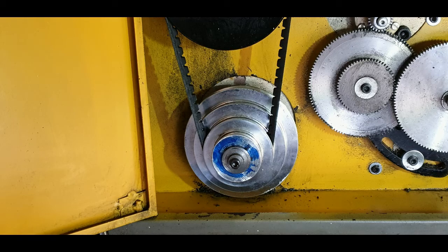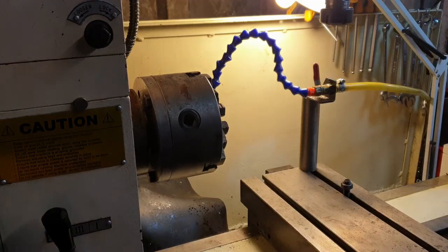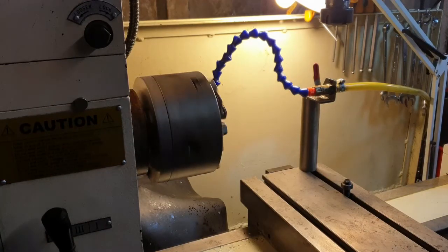When searching for a 19 millimetre stepped pulley, the only one I could find was a five-step. However, as you can see in this photograph, there are only four grooves — I had to machine the fifth step off the pulley. With everything fully installed, I also treated myself to a new set of V-drive belts. I went to the local garage, took the existing belts, and found the closest fit replacements. They are quite easy to obtain and only cost about four pounds each.